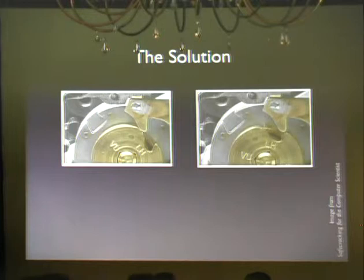In which case, that guy goes out of business, and he's very sad, and he stops buying locks from this manufacturer and tells all his friends who make safes not to buy locks from this particular manufacturer, and so they have to make sure their locks work every time. This means that they rounded the corners of the gate so that everything would work smoothly every time. This has the curious side effect of allowing you to measure very precisely how far the fence has dropped inward into the wheel pack.